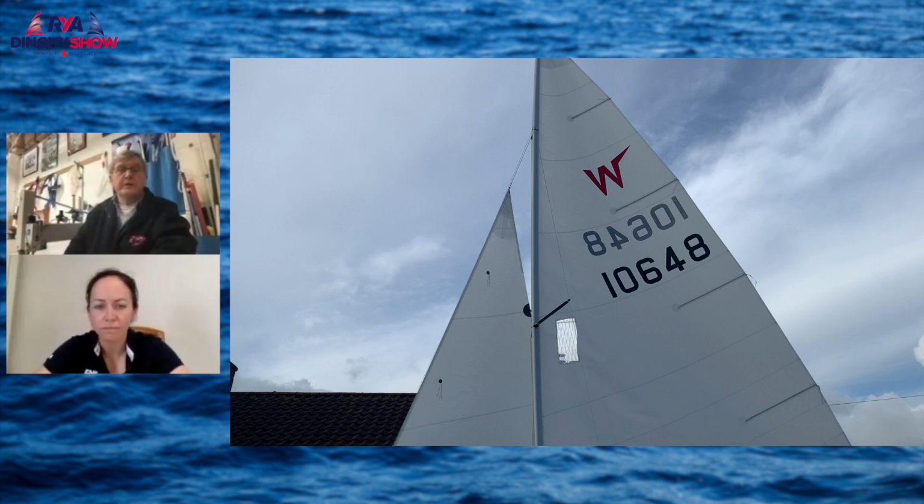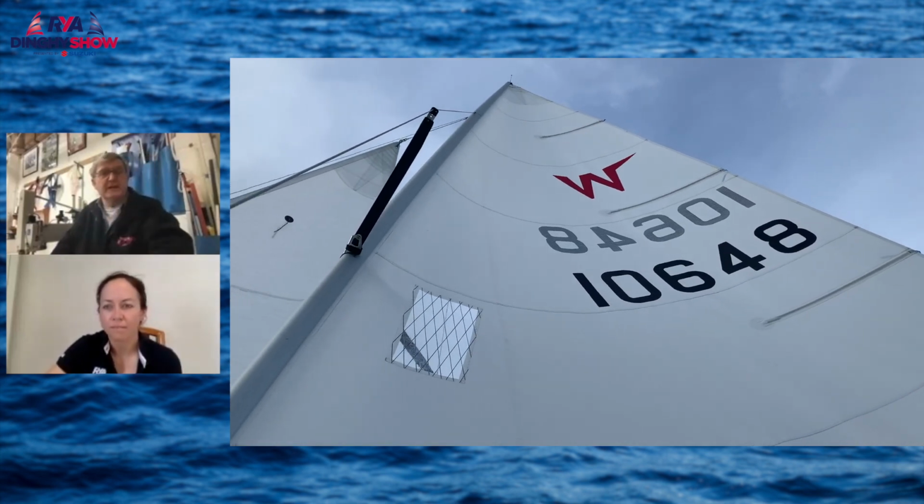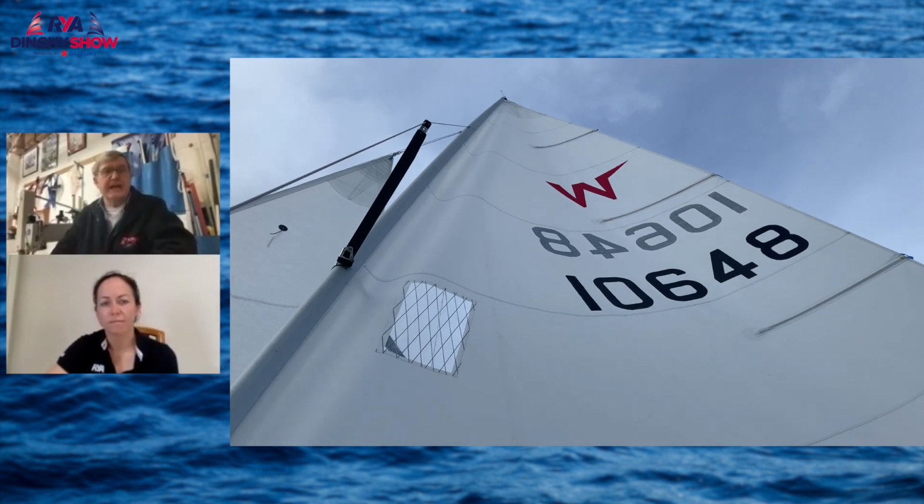Right. Look what happens, however, if I overdo the Cunningham. Can you see, by overdoing it, I've created a ridge right behind the mast. How can the air possibly get round that? I mean, that's much better, isn't it? But look what I've done, because I'm over tensioning across the diagonal. But look also, as I ease it, what happens to the leech of the sail. I hope you saw that the leech slightly firmed up there and a telltale appeared. Over tensioning the Cunningham drags the flow forwards, eases the leech, and in my sort of boat, stops you pointing. If you can't point, the wind hits you more from the side, more heeling over, more sitting out.